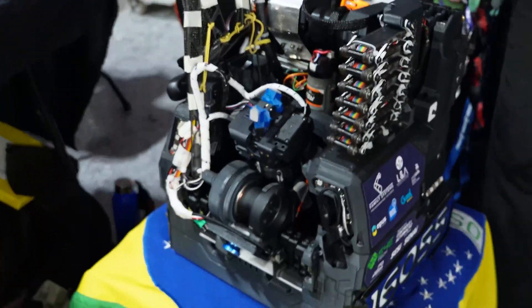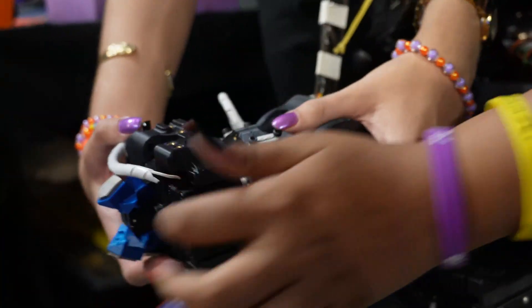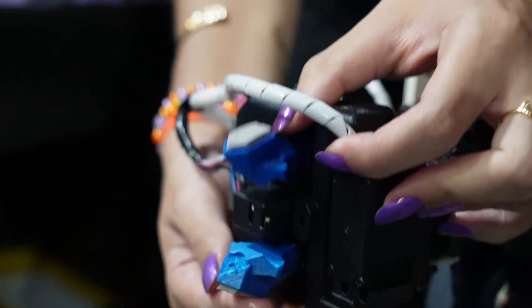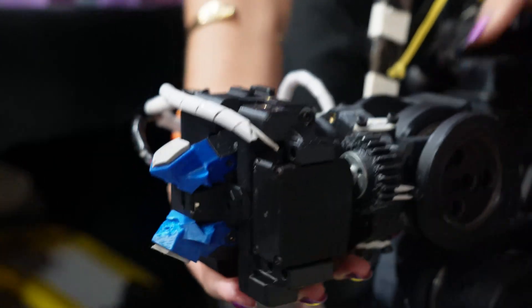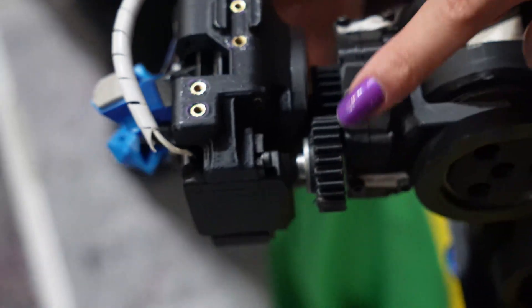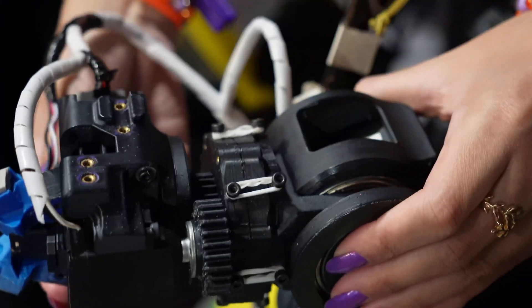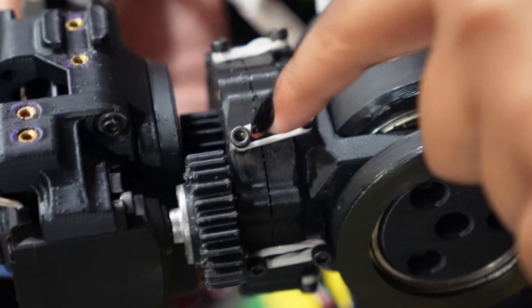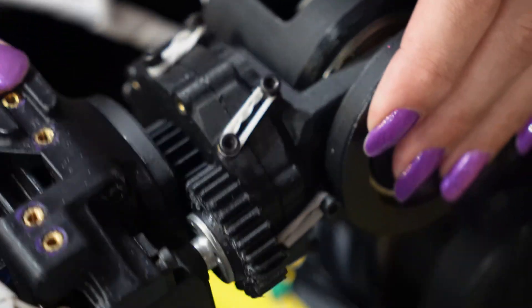Now for the robot, we have two main mechanisms. One is on the tip of the claw, which we call the adaptive claw — a system responsible for collecting the sample by the feature of it, so we can be assured that it has a perfect grip on the inside of the sample. To be able to collect the sample anywhere on the arena and make the process easier, we also have the self-adjusting wrist, which is a mechanism that is both active and passive. The active part helps secure it in the right position, and the wrist bands — the passive part — help the claw always return to the correct position and make it as efficient as possible.